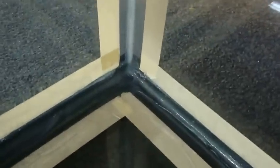Now that all the silicone is smeared around and packed into the corners, it's nice and smooth. Here's a shot of the outside — nice smooth lines. You want to peel the tape away while it's still wet, you cannot wait until it dries. Very carefully peel the tape away — that's how you get a nice smooth finish line on the silicone.